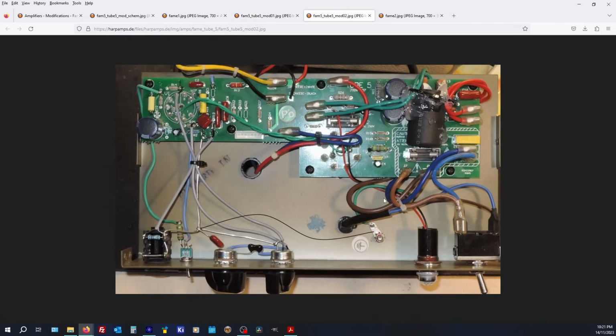Anyway, moving on. So there's another view. Oh yeah, it's just had some nice hot snot action. Again, that resistor's blown. Someone's replaced it with a metal oxide. You can see that heat damage on the board underneath. This one, actually, they've removed the circuit board altogether and done point to point. I don't know whether there's any real advantage to that, but, you know, whatever floats your boat. If you want to spend a week on this amp, go for it.